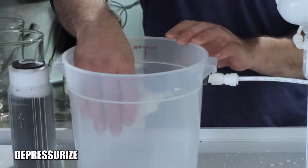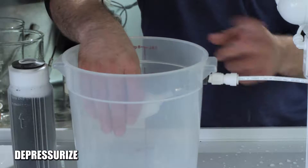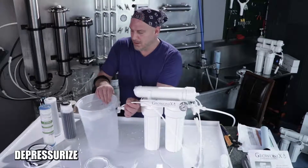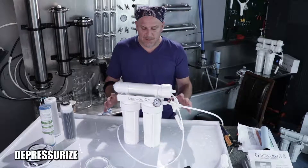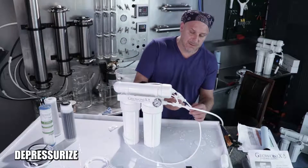If the tank is full, pushing the float valve up is holding pressure, so pushing it down momentarily you'll see some water spew out — that means the RO side is depressurized. Of course you could always unhook it as well. The unit holds a little bit of pressure even with the RO side undone; that pressure is held to the ASV.